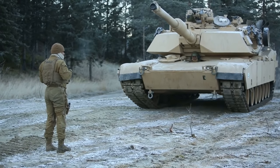The turret houses the majority of the weapon systems and all of the crew except the driver in the fighting compartment. It therefore gets the lion's share of the DU armor. It is capable of rotating 42 degrees per second and tracking a target at 4.2 degrees per second. Elevation tracking speed is around 1.4 DPS to a maximum of 42 degrees. This means a full rotation in just over 8 seconds, or accurately tracking a target moving at up to 40 miles per hour.